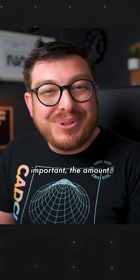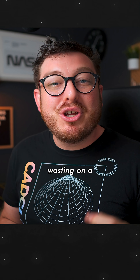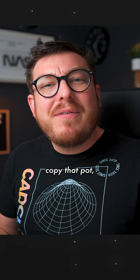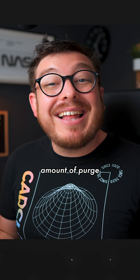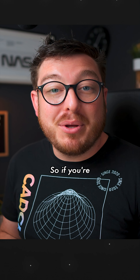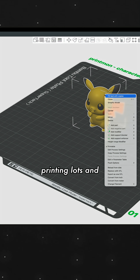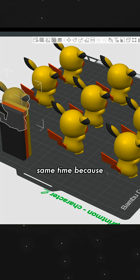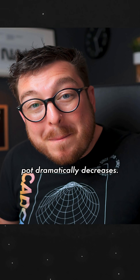Finally, and most importantly, the amount of material you're purging and wasting on a single pot can seem really substantial, but if you copy that pot, it still has the exact same amount of purged material. So if you're planning on batch printing lots and lots of pots, make sure you print them all at exactly the same time, because the amount of wasted material per pot dramatically decreases.